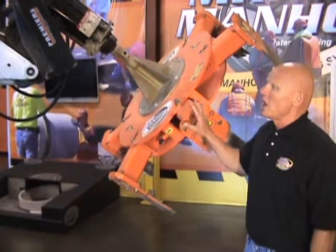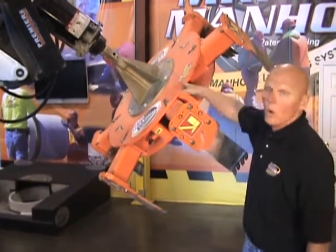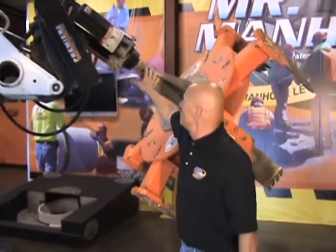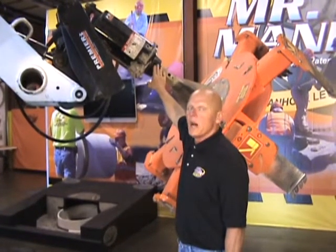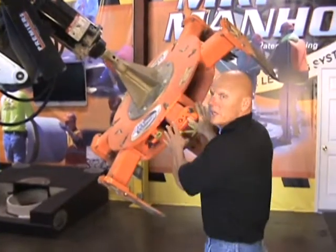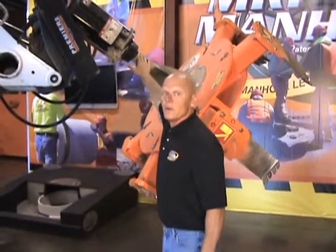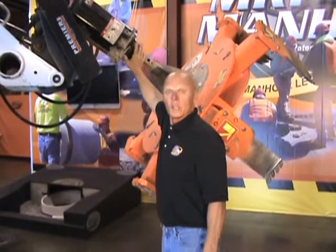The operator must not use the tool or transport the tool oriented in this fashion. The attachment point, and indeed the seals and bearings inside the auger, are not meant for this kind of loading. This tool weighs over a thousand pounds, and to put that kind of load on the seal and bearing is not going to bode well for the auger.